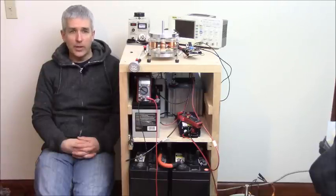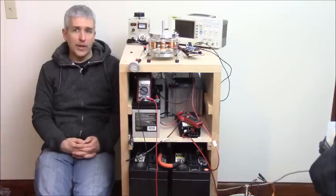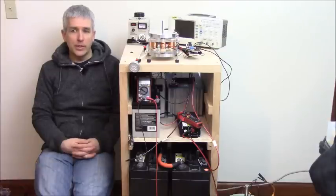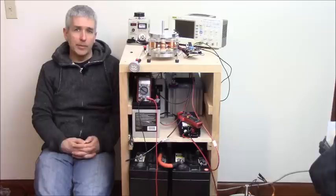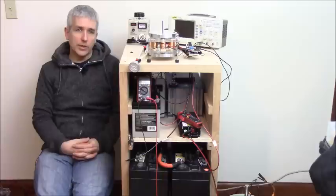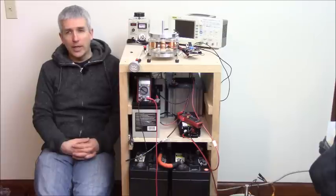So this is where you have to deal with a compromise, where you cut it off. And once you cut that off, you're creating a short across the MOSFET. So it's clamped on. So this is where we don't want too good results unless we had a very high voltage switching device, which is, you can get into IGBTs, but usually you only go to the IGBTs if you're pushing more amperage, because they don't operate very efficiently with low amperage, but they do high voltage. So, the MOSFETs are coming up in voltage, and there's various mechanisms to do switching, but you can't do ideal because it's too costly.